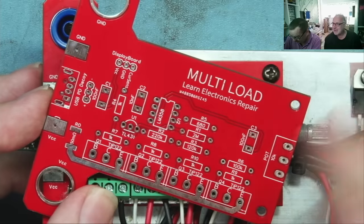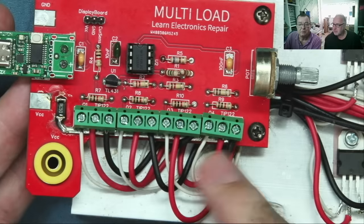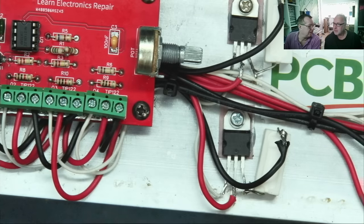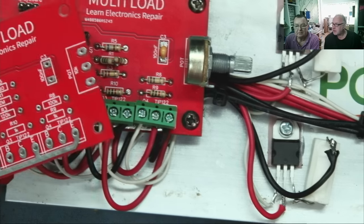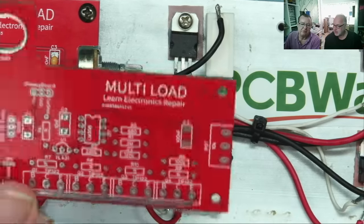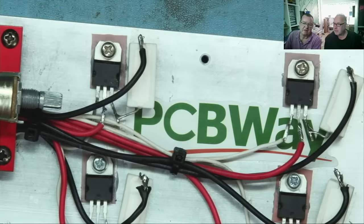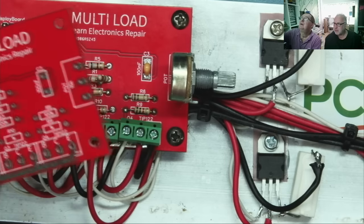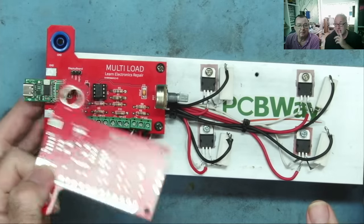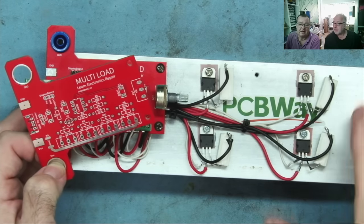That's it. So, as you can see, we have the connectors here, which go to the power transistors. That's these wires. I've put the emitter resistors down here, but they could just be easily attached from here as well. But this way you cool the resistors automatically, right? Exactly, yeah. So I think personally we don't need to change the PCB. We don't need space on here for large, high-powered resistors. We just sit them next to the transistors like so. Normally I have two or three versions of a PCB. This is not the normal way. I'd guess that we would need at least two versions, but this is good. Okay, yeah. So for now, they're going to stay there.